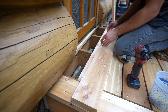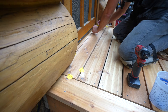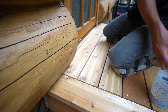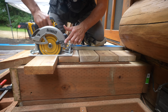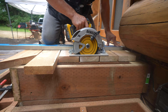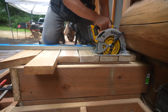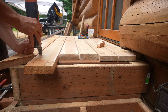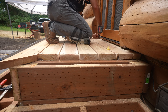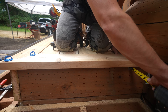This piece fits snugly into place, and I'm able to maneuver the board alongside it with all the shims perfectly spaced out. Once we screw them down, we can move on to our final border board. All these boards are cut long because I can take a circular saw and do a nice rip cut all the way across the line we previously laid out. I suggest having some type of straight edge, like a level, to butt up against your circular saw so you have something to guide the saw all the way across. However, my circular saw can only go so far, so I'm using a multi-tool to cut any remainder. I did take off one board that was just too difficult to cut with the multi-tool due to the large log cabin we're going up against.